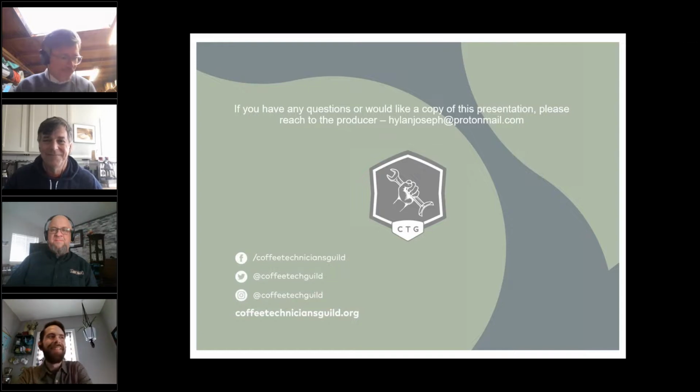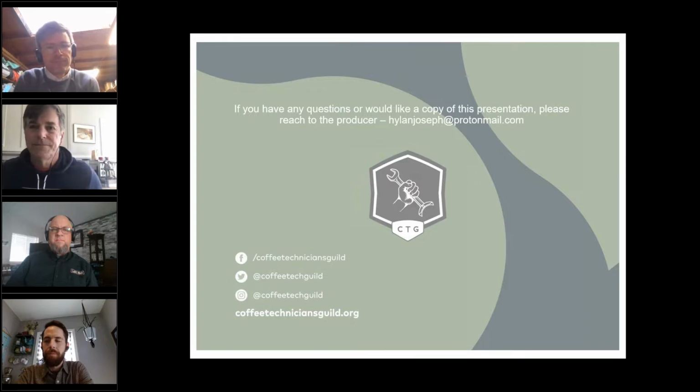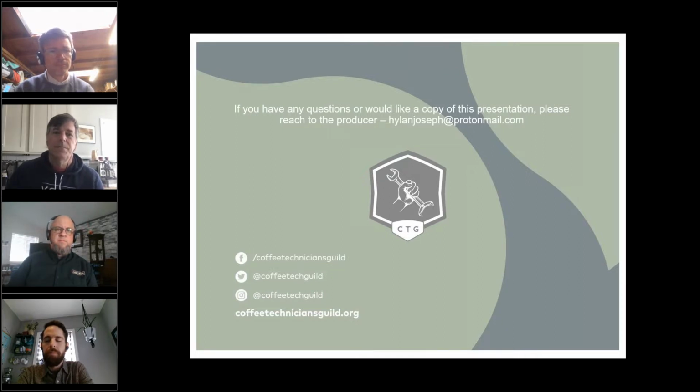What I wanted to say was, yes, Arno is correct. Start with the stuff that needs to be done most frequently, because that gives you time to recognize what machine you're working on individually and figure out the timetable for cleaning or maintenance or other systems. One I will add is impellers. Those fans have got to be clean because they've got to move. The more buildup they have, the less efficient they are, and you wonder what's going on with your roaster because your roasts aren't completing on time. That's a really easy fix. So techs should look at easy things that owners may not have thought of because it's not on their mind. That's where I would start.